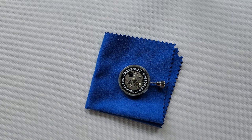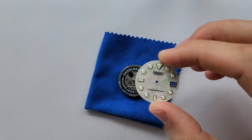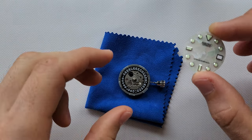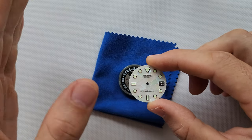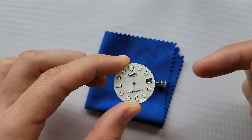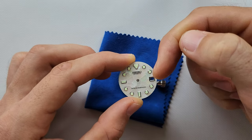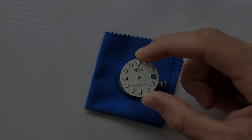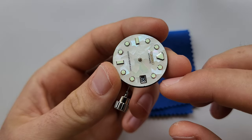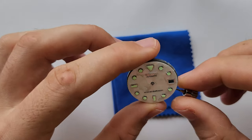Okay, it's done. And now the most important part — I have to place the new dial very, very carefully on the movement. Make sure the source of light is from the side, from this side. Otherwise the shadow will fall from the front and it's really hard to align it. Looks really good, right in the center. Great.